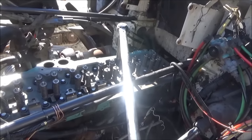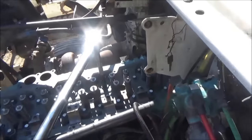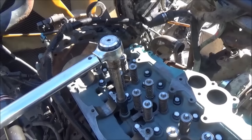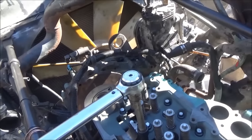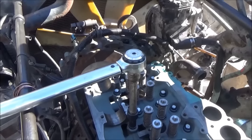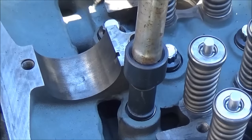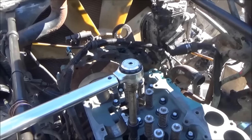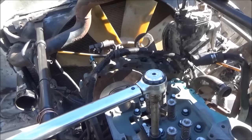200 foot-pounds with one hand — that's because I've got a four-foot torque wrench, three-quarter drive, with a reducer on it and a socket. I better mention that when you need extensions on a three-quarter inch torque wrench, use the thickest, best-sized three-quarter inch extension before you get down to your reducer that changes to half-inch drive for the socket. If you use a half-inch extension with the reducer up top, the extension will twist like a spring and absorb a lot of that torque, and you won't get accurate torque readings.